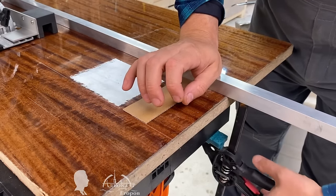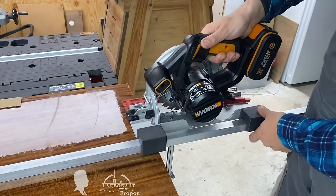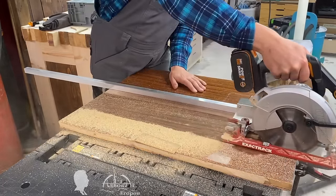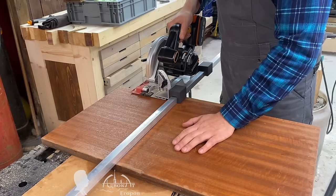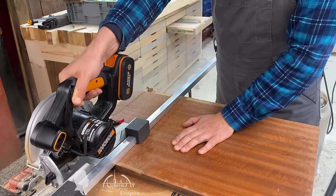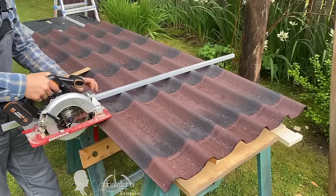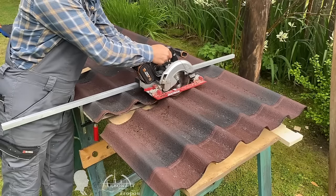A few words about how to mark the cut and position the rail. You will need to cut out a piece of cardboard or plastic and use it to set the gap between the cut line and the rail. I admit it's a bit inconvenient, but for the jig's unsurpassed accessibility and convenience, you have to pay the price. I have already started cutting the workpiece for a perforated countertop for a standard 32 mm furniture system — the geometry is very important here, which is why I cut along the rail. When carpentry precision is sufficient, it is easier to make a cut using a carpenter's square. It is also more convenient to cut materials with a curved surface along the rail, for example a piece of roofing — one could easily secure this affordable rail even on such curved material.